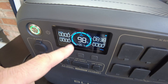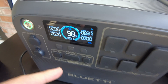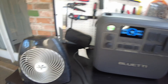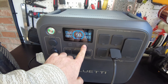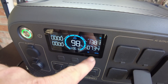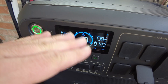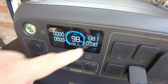We got this thing almost completely charged up and it charged very quickly. Now I want to plug in some AC loads and test running AC while we're plugged into the grid in UPS mode. We're going to plug in this heater and turn on the AC output. We're doing 737 watts out and 1,381 watts in. It actually boosted the input wattage back up because it was only doing 800 watts to finish charging the battery, but brought in more power to run the AC load.